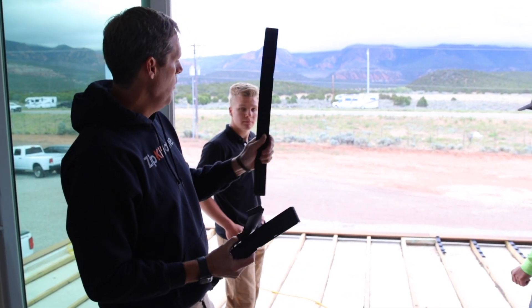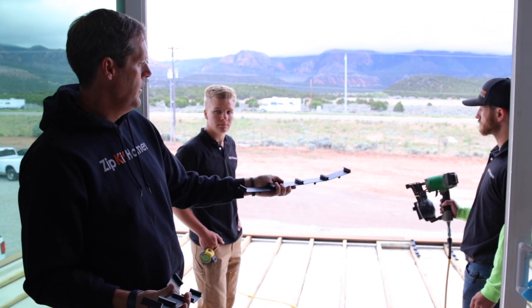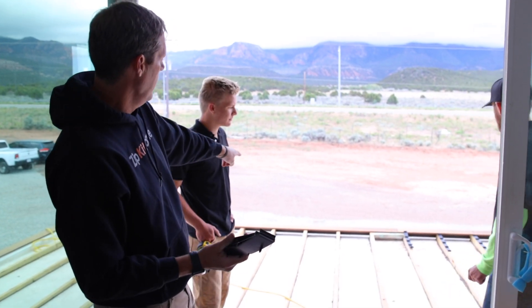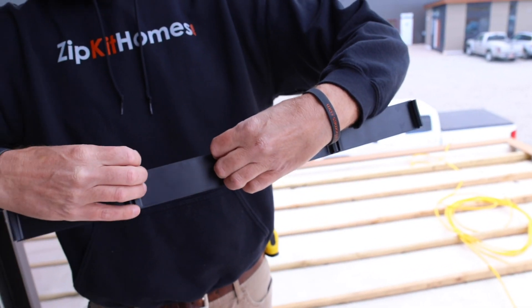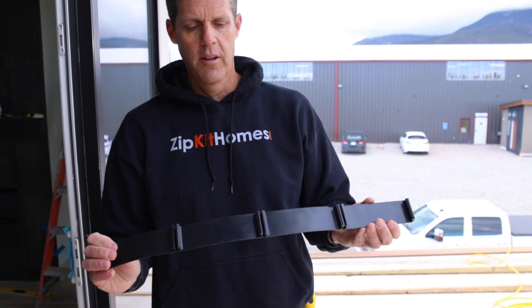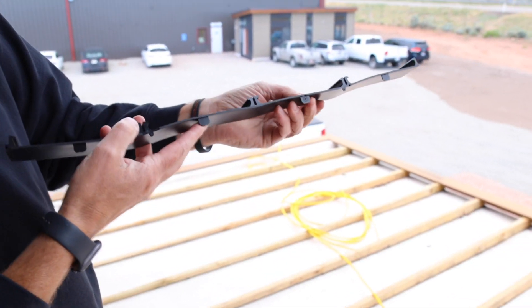Now we're going to show how we connect these down. All you do is nail it down with a roofing nailer. They send out coil nails — it's just a basic roofing coil nailer. Using galvanized nails since it's obviously going to get wet. It's important that we start it right in the beginning, so we've chalked the top line so we know exactly where each one of these little black clips goes. They'll nail it on and then we'll show you how everything goes together. It's a clip system — the piece of decking has a notch and just clips right in. The old way requires spacing each piece with a nail or spacer, which is kind of a pain. Hopefully this works really well — it's got little clips so you know right where to go on the stud.